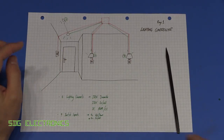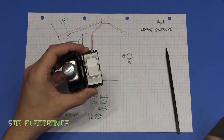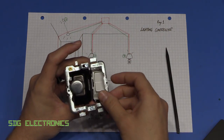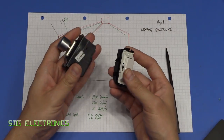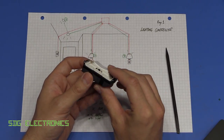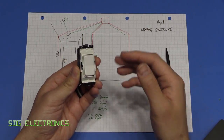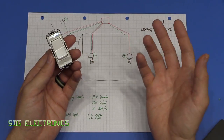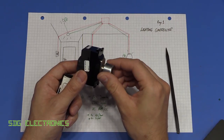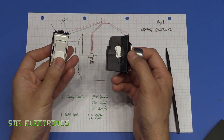The idea is to use normal type switches. In the house I've got the MK grid system installed, where you buy modules that fit into the grid and then buy a faceplate in whatever colour and style, giving you a customisable series of switches for each application. For the bedroom I'm thinking of using retractive switches, which are effectively a rocker switch with a centre-off position, so you can hold the button to dim lights up or press it down to dim them down, without needing rotary encoders or potentiometers.